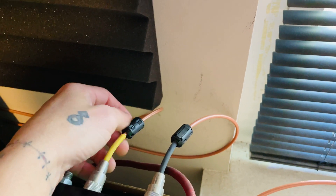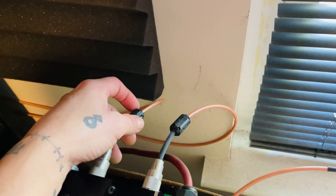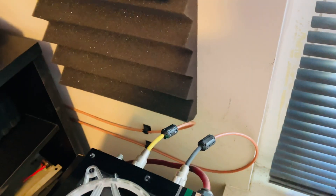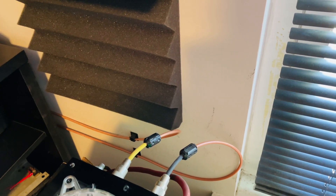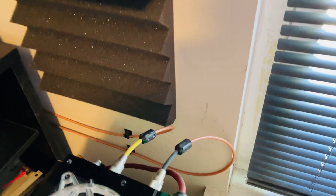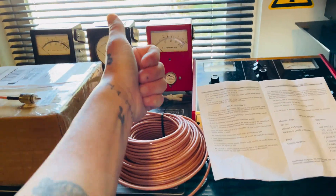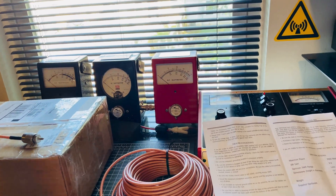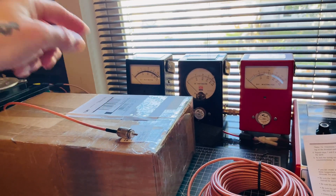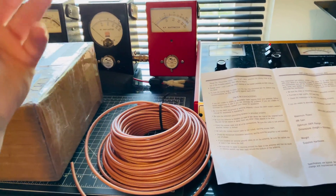Best bet on your jumpers: one or two Mix 43 ferrites. At your main feed line closest to the antenna, you want about four or five — no more than six Mix 43 ferrites. That will help with the impedance choke, keep everything running out to the antenna, prevent signals from coming back down your main feed line, and also help with common mode currents.